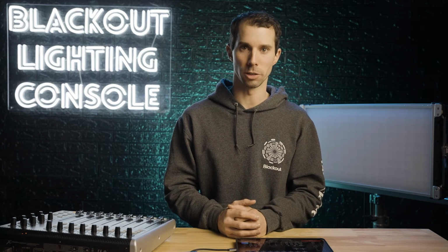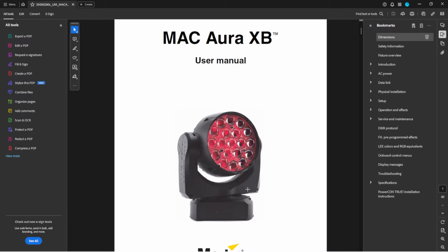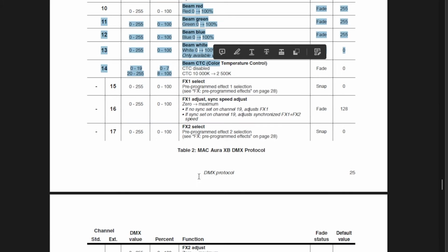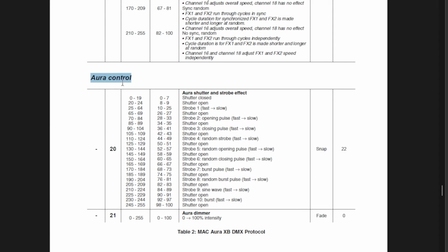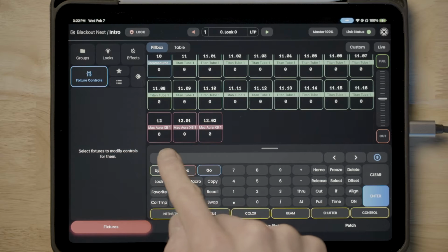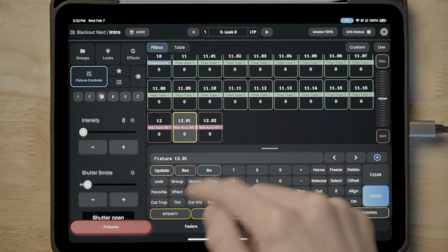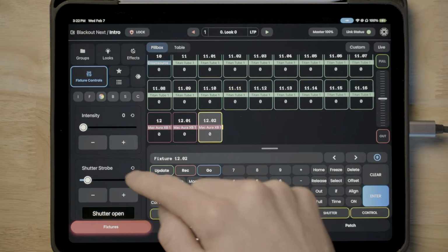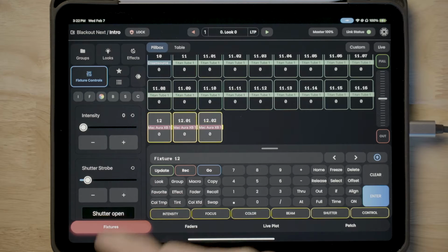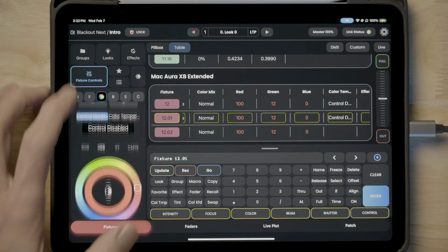Furthermore, moving lights, although they may be a single head, maybe even with no pixels, can still have a foreground and background element or an effect layer, and those are now modularized to help for greater control over a fixture. The idea is that you can select the pillbox to see just the parameters within that module. Otherwise, if you have a foreground element that has RGB and then a background element that has RGB, it's really hard to show 2 color wheels in one layout and easily understand what you are controlling as a user.